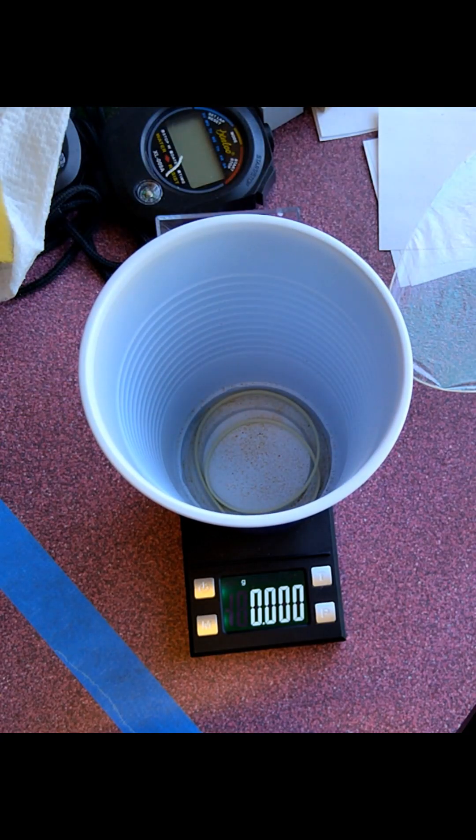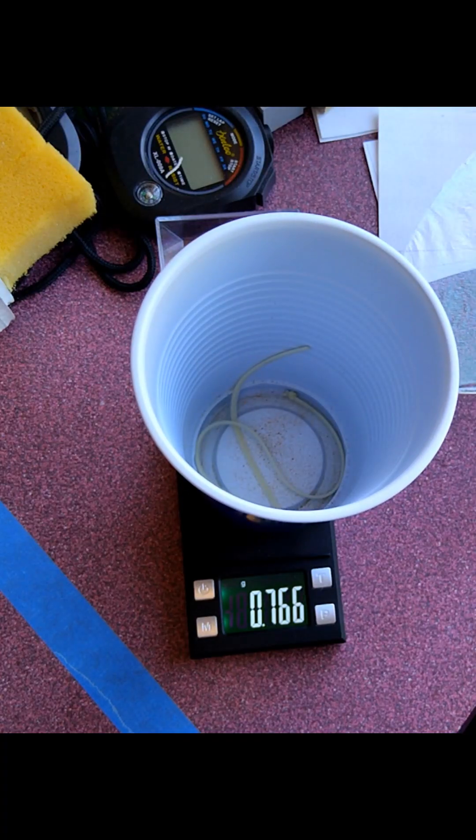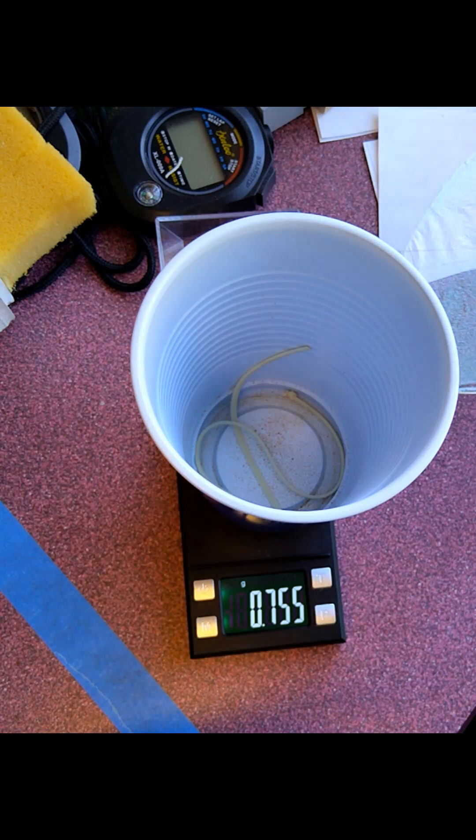We weigh the motor and we see it's about 729, 730. Wipe the motor very well with a paper towel very aggressively to get any oil off, because let's say you were right at your maximum weight of the motor. We drop it in the cup again and we see it's 755 — so it's gone up by 25 to 30 milligrams.